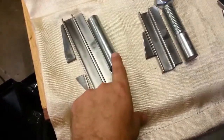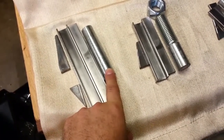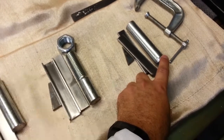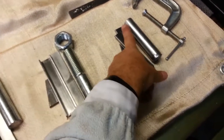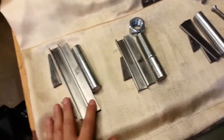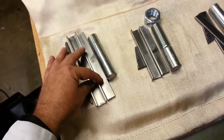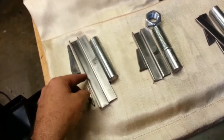This is that 1 inch by 8 bolt that I showed you guys before. Here's the bottom part of it, and I actually went out and bought another one. This is a shorter bolt that I just cut the bottom off of, or actually the top, I guess. The hex head would have been up there and the threads would have been down here. So this is going to be welded now, so I'm going to do a little bit of welding. This is going to get welded together, and then this is going to get welded to here, and then these are going to get welded up underneath.